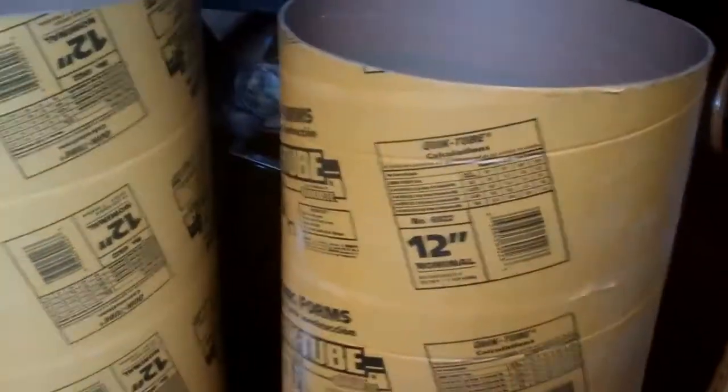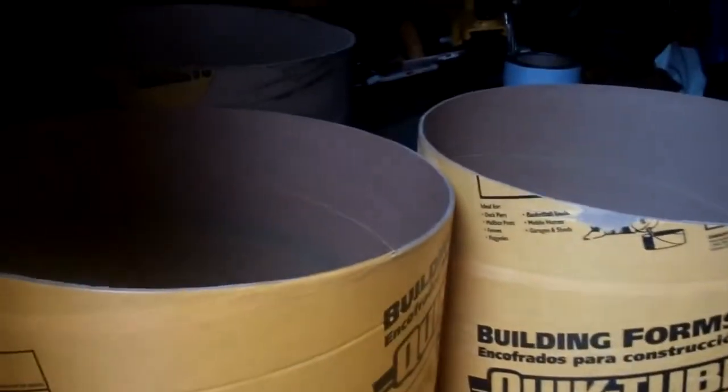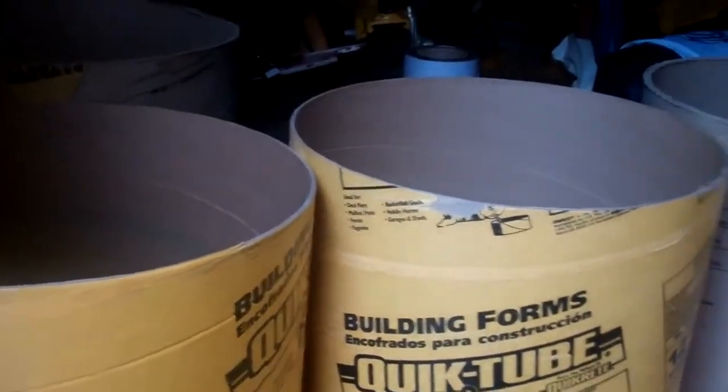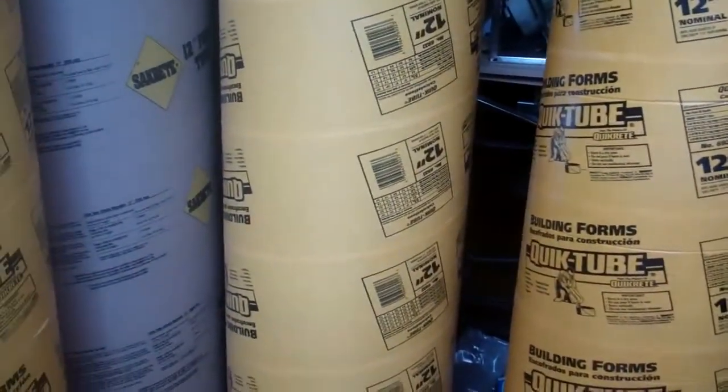We're on to starting the construction phase now. There's some more of the tubes — got them stored in the shed because of the weather — but we've been picking them up little by little. One of the weird things: these things say 12 inches on the side, but we've taken measurements and some were like 11 and a half. The tubes were inside the tubes. Apparently that may not be a big deal, but we've heard of inspectors failing piers because they weren't true 12 inches, and we're not going to take any shortcuts here. All these tubes are exactly 12 inches and the 11-and-a-half-inch ones we've passed.